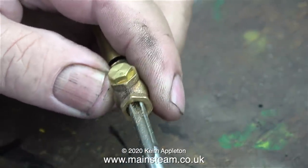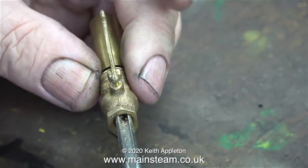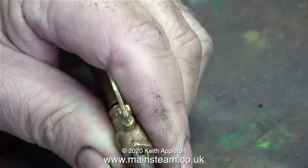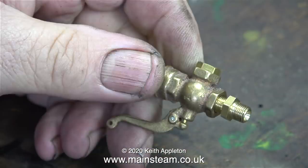The other thing: PM Research quarter by 40 threads are not the same pitch as we use in the UK. So just like the elbows, I re-thread them using a tap with the correct pitch.